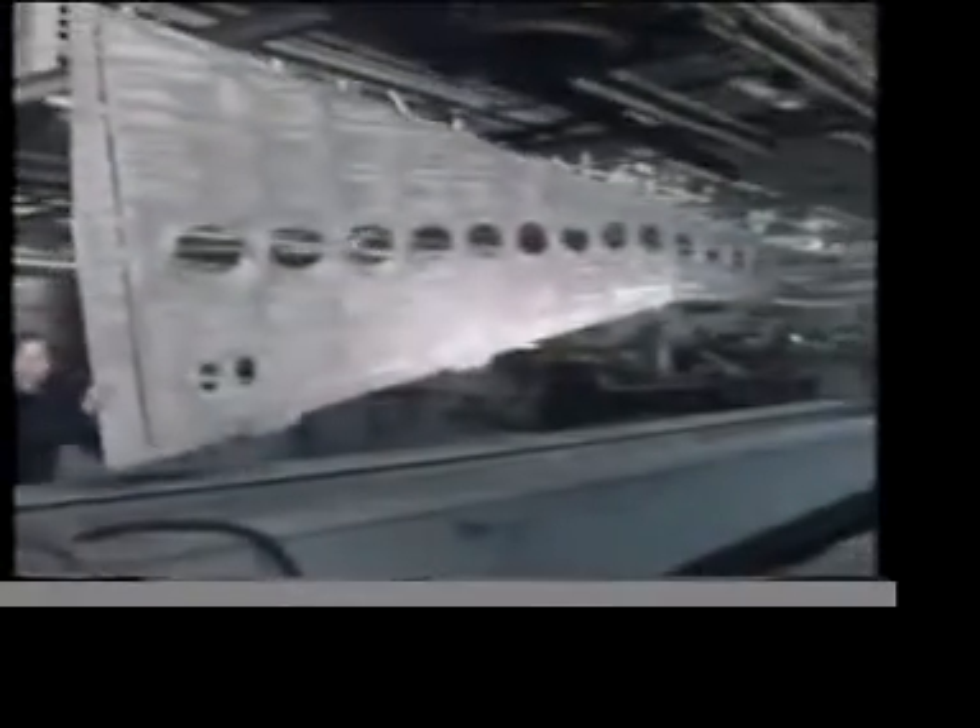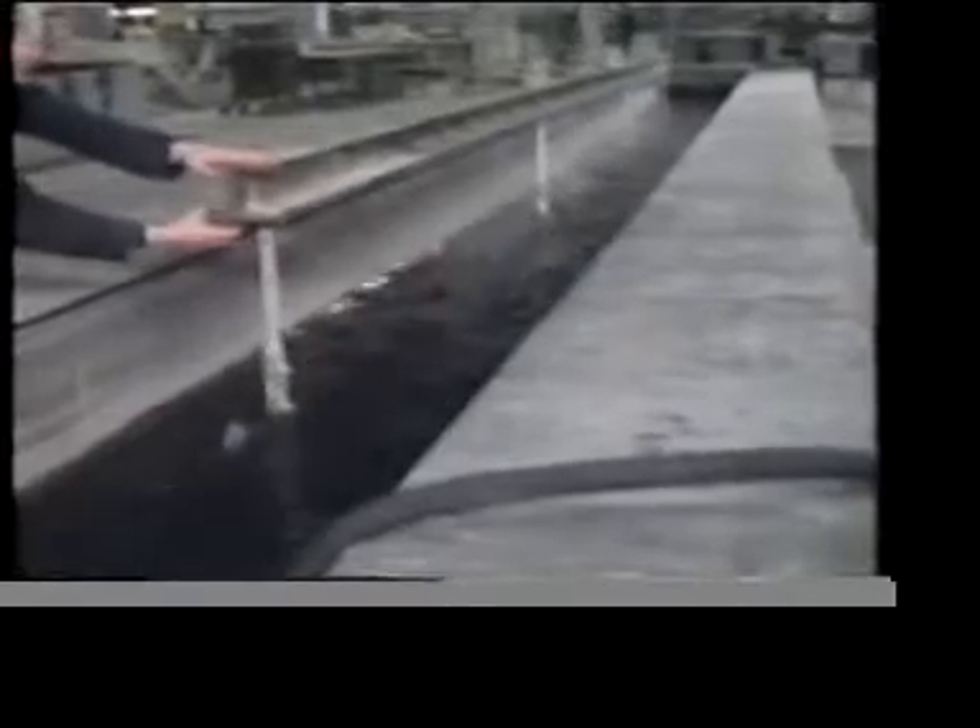Part of the wing skin of an aeroplane. It's another aluminium alloy, and it has to be strengthened by stringers which are joined on by an adhesive. The surface must be prepared first before the adhesive can be applied — another very important factor that affects the efficiency of the bond. The skin is immersed in a tank of very strong detergent solution. The contents of the tank are agitated to keep the solution moving over the surface of the skin. The detergent removes any grease that may be present. The skin is left in this solution for about 30 minutes.